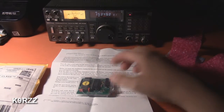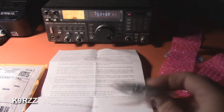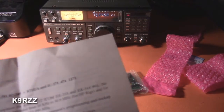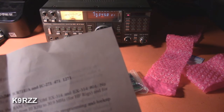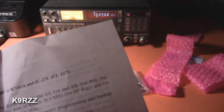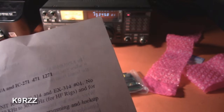Today's project is I'm going to replace the battery on the R71E I got from China. The seller says he changed it, but I'm going to be sure, so I'm going to replace it with the Robert Nardo IK2RND EEPROM RAM board. The EEPROM RAM board card directly replaces the RAM unit from ICOM. No soldering is needed, and the radio frequency coverage is extended from 10 kHz to 30.9 MHz, instead of 100 kHz to 30.1 MHz, so I'll be able to tune in WWVB on 60 kHz.